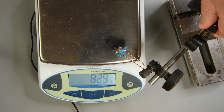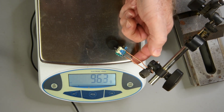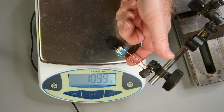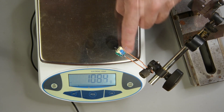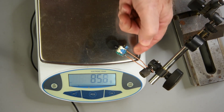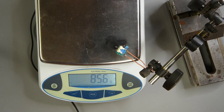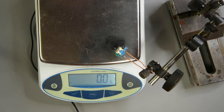Now with the Alps joystick, it looks like it may be around the 110 gram range before the joystick moves. So it wasn't my imagination that the Alps took a bit more force. The spring pressure seems to be in the 105 to 110 gram range. With the joystick close to full extent, getting a pretty consistent 85 grams — about the same as the Favor Union. So it's just the initial force needed at the start. I wonder if that allows the Alps joystick to return to a more consistent center position.